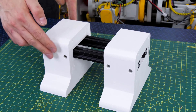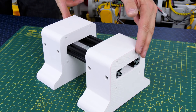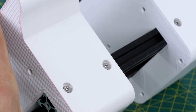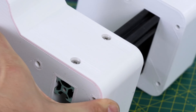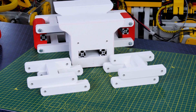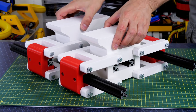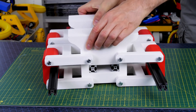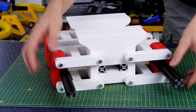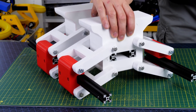My new design has suspension arms. The central block of the machine is two bits of 20x20 extrusion attached with T-nuts into the slot onto some 3D prints that make up the main body and hold the other end of the arms. I've got multiple suspension arms and also the part that holds the wheel and the four-wheel drive mechanism. With that all bolted together I've got quite a substantial body, and each of those four suspension assemblies can move independently.